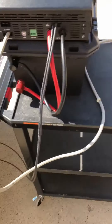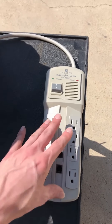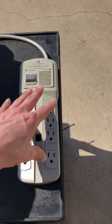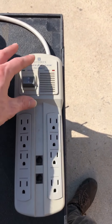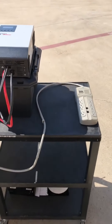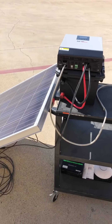What I did to it was just ran a power strip off of the AC output, which is a simplistic way of doing it. This really should be breakered — there's an input breaker here for the AC input, but there's not an output breaker. Really you should get a power strip or other output source that has a breaker inside to protect this wire from having too much power going through it if something shorts. But that's just to show as a demonstration: solar in, battery charging, AC output to your AC loads. Super simple.